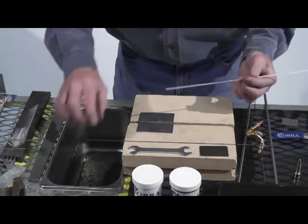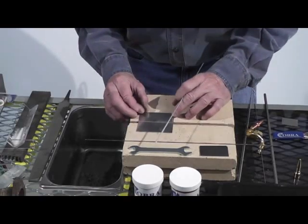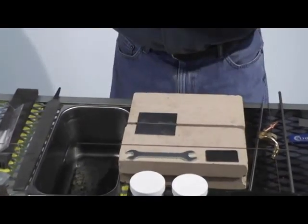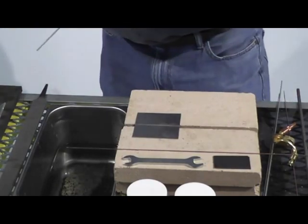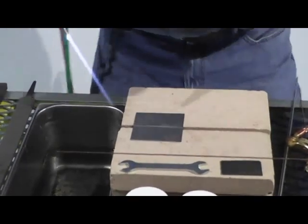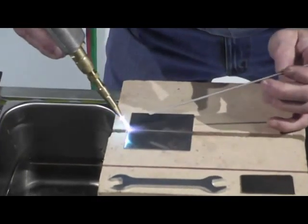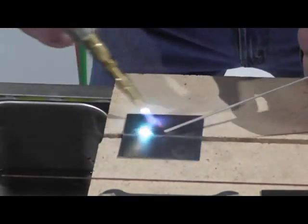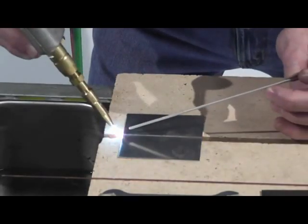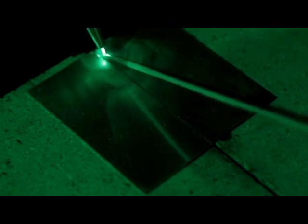Just put a real thin coating on the rod — you don't have to put any on the metal. Make sure you've got a good fit up. You also need a special pair of glasses to weld aluminum. Always take that cone down, and just sort of preheat that metal a little bit. The larger or thicker it is, give it a little more preheat; get the aluminum where it's just starting to melt, and push the rod in.